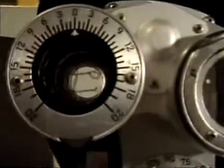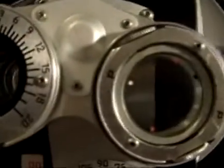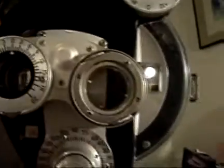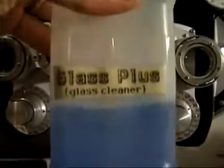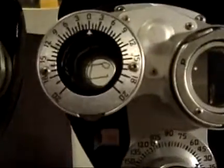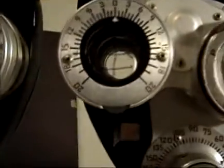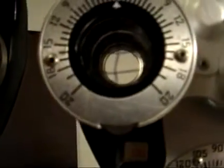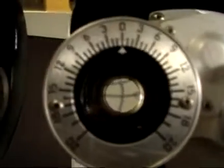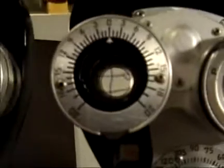I got a good optical alignment on both of these Risleys. The markings from the permanent marker can be pretty well cleaned off with a lens cleaner such as Glass Plus — I have it stored in an alcohol bottle because it's easier to deal with. Any remaining markings can be removed with a small touch of rubbing alcohol on a Q-tip, but usually the Glass Plus will clean off nearly all the markings from the permanent markers you put on the lens.